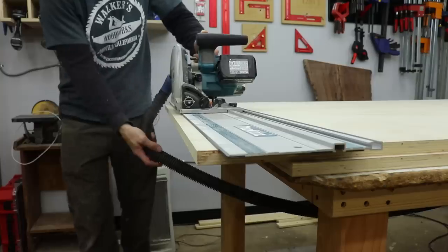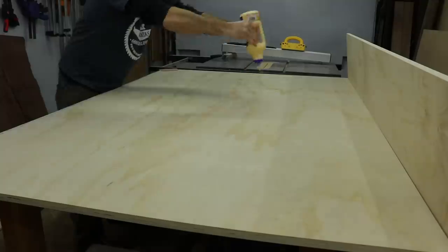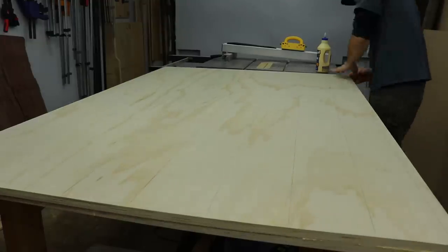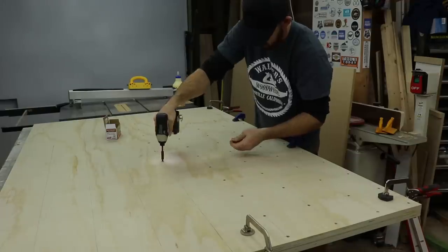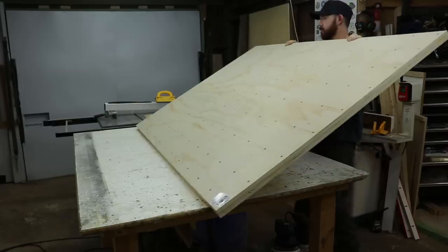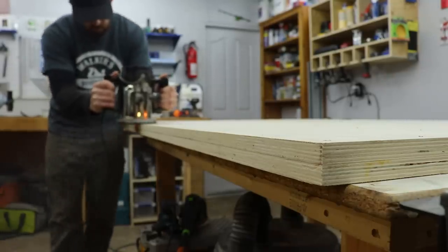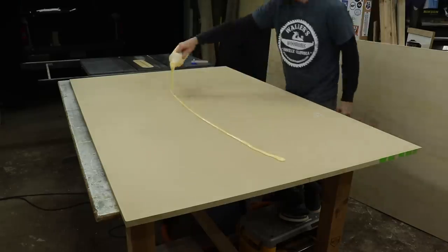Which in my case was six foot by four foot. I only trimmed down one to the final size, and then as I laminated them together I used a flush trim bit to make them all exactly the same size. To laminate them I just spread an even coat of Titebond 2 all over the face of the first sheet. Once I had the top piece on evenly and clamped down I started putting screws in — I went a little overboard with the screws but they act as clamps. The flush trim bit is just a router bit that's straight and has a bearing on the bottom; it follows the bottom board and trims the top to the same size so you have a perfect edge. It's a lot easier than trying to cut them both the same size and then put them together.